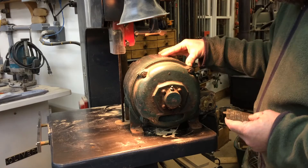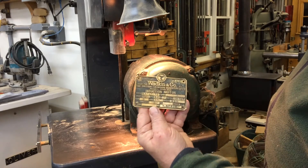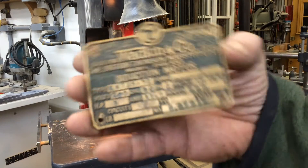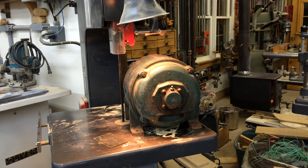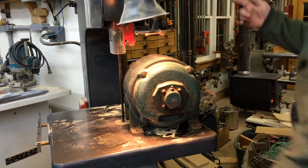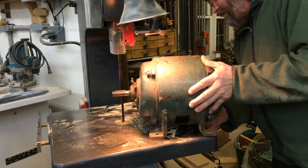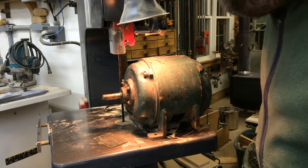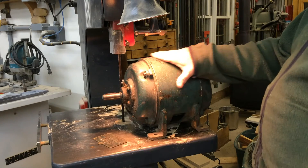I'll be putting this on the Wadkin RM — it's the appropriate frame for that right area. And of course I have a Wadkin motor tag that I'll place on there so it's more authentic. I'd like you to listen to it — it's incredible. I'll turn on the rotary phase converter. I'll just plug it into the disconnect and throw the disconnect. Incredibly quiet. Nice slow speed motor — very hard to find. Open bearings, and no vibration at all.